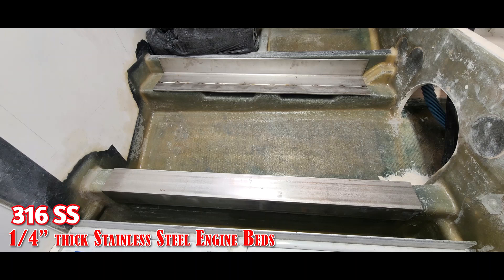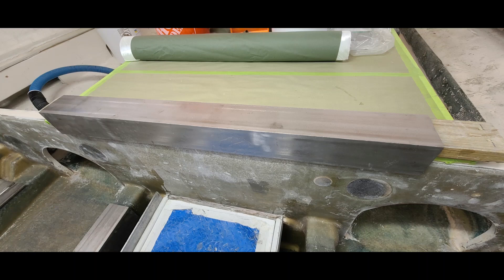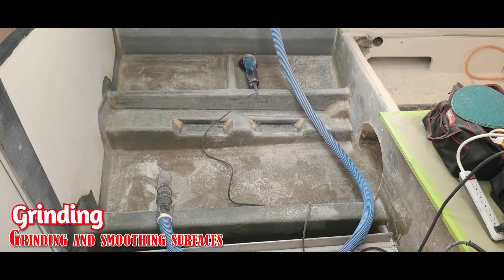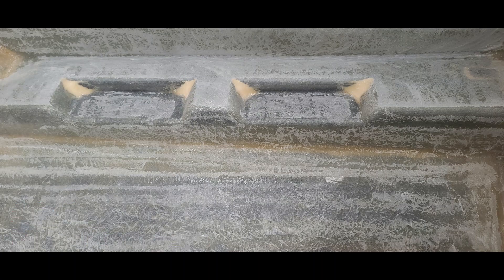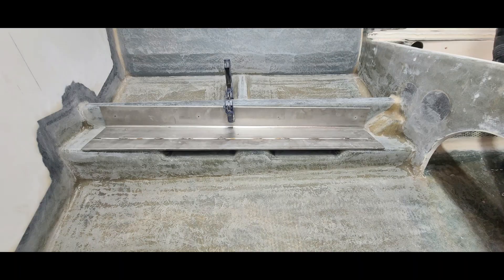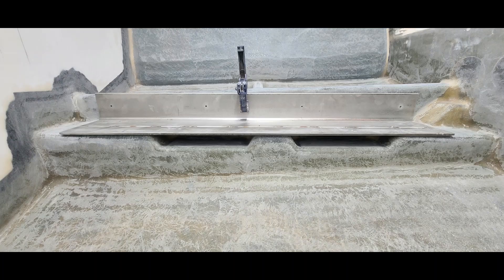Here we are with the stainless steel that's getting ready to get pre-drilled. We're just drilling pilot holes, and of course we had to do a little smoothing, just so those angles sit very flat and tight into that corner. There is the outboard engine bed. Those holes were pre-drilled and we drilled pilot holes through the stringer. The recesses will allow us to through-bolt the isolators.